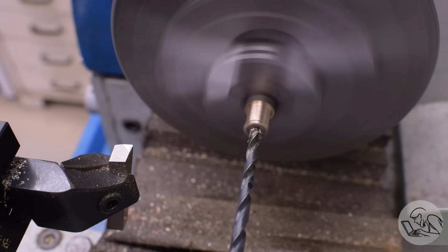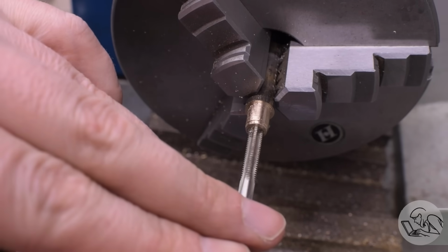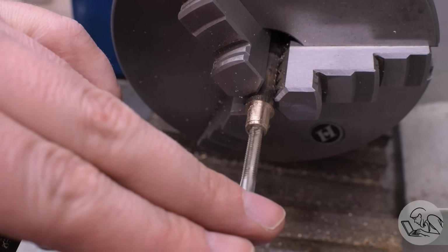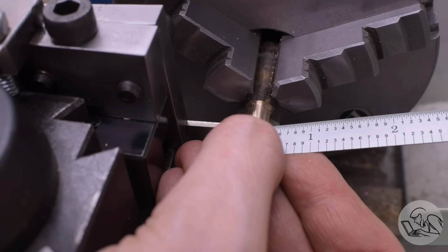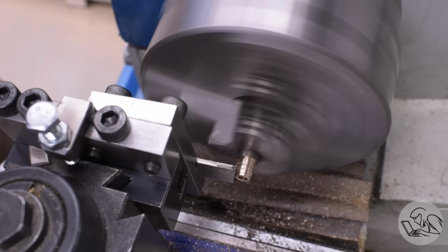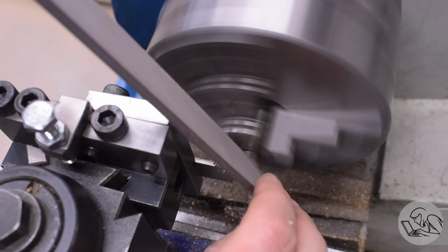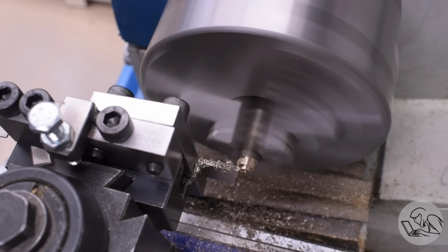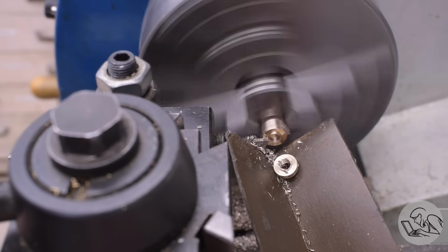I've never even seen a BA thread here in North America. I've been working on mechanical things my entire life, and I've never seen or heard of anything BA anywhere. So that stuff's just unobtainium here. I could special order online somewhere the fasteners and the taps and dies and stuff, but we're already here. I've made the M6, I've made the 10-32, and they're compatible, so we could just get away with that. And Yahtzee.